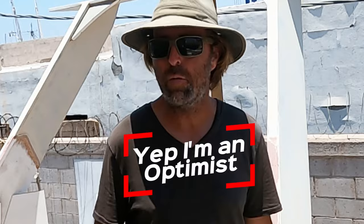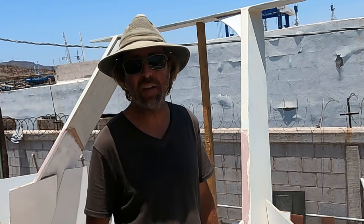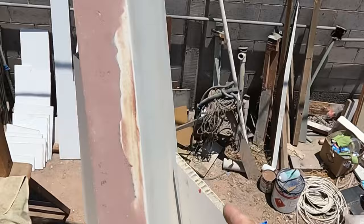Anyway, a lot of details are going into this, and in the next 2 weeks or so, I think we can pull it off. So right now, I'm going to start mounting the arch and get that 2x4 out of the way. That's just holding it up so it won't fall into the parking lot. Let me show you how I creatively got the height I needed and put it in place. So basically I cut a line in the wall, which will help support it. And that's my 14 inch mark, that green line. And pretty much I cut the angle onto that as well as onto this side. And it fits very, very close tolerance.